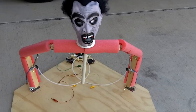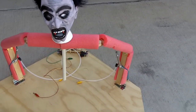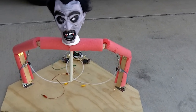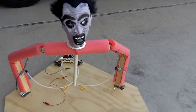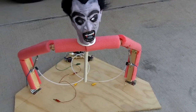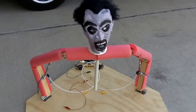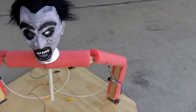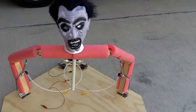That reference build uses two by fours and dual action cylinders — basically you've got to fire and retract for each one. I had this thing set up initially with two by fours, but it just took too much PSI — it was too heavy just with the frame. So I rebuilt it using one by twos, hoping it's going to be sturdy enough. We shall see after this year.